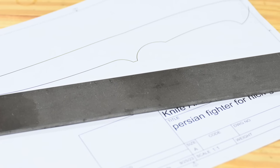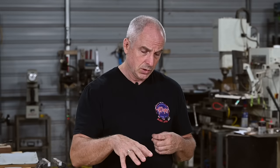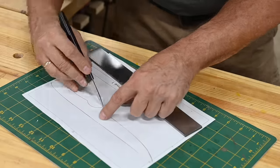You could argue that the steel I'm using today, 154CM, is maybe along with ATS-34 one of the first of what people now call super steels. So, kind of an old-school steel, but the great thing about it is it's easy on the wallet and you get a lot of performance at a pretty reasonable price. What I'm going to be using today is ingot steel, not powdered steel — there's a powdered steel variant of it. Joey at Pops really likes this ingot type because it has larger carbides, and that gives a kind of toothy cutting edge, a lot of bite on the cutting edge when you sharpen it. Because it's been around a long time, heat treaters understand it well, so if you want to send out your knife for heat treating instead of doing it yourself, this is a great choice.